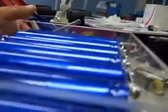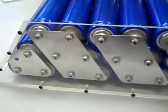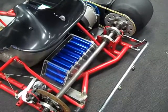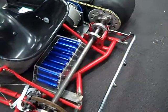What we're going to do is put it in here. I've got to bore a hole through the side, or I might just come down from the top, so I can put in a lug to be able to tap off some power - and down there, another lug to tap off some power - but that's going to be for another day. There's one box done. Now positioning the first battery pack - first 24 volt battery pack - nice down low, keeping a nice low centre of gravity, keeping it forward of the back axle so that we don't get a pendulum effect in the rear, which is what happens with some electric go-karts.